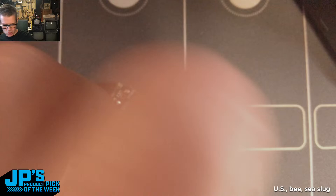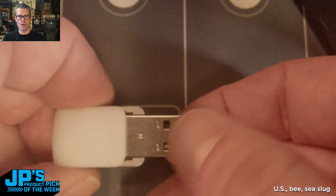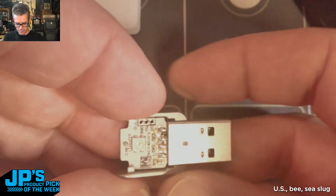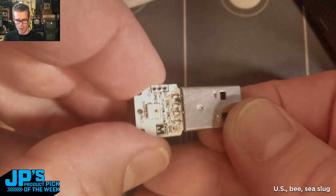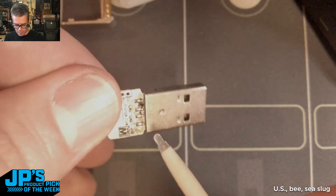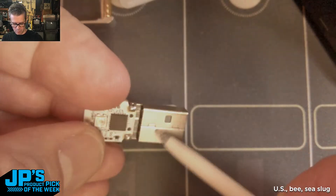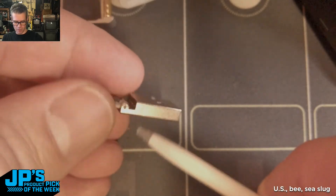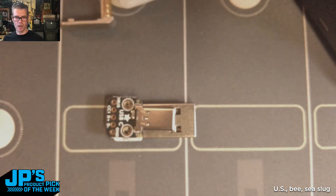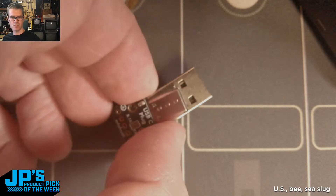There's a fairly standardized color set: green for data plus, white for data minus, red for voltage, and black for ground. So those connections go from the breakout to the board, giving a nice neat little package — but that could be any circuit you imagine. For a better look pre-surgery, this is another USB device: our good friend Todd Kurt's blink one, which is a USB-A programmable NeoPixel or RGB LED pair. You can see right at that connection there are four solder points. It's a pretty destructive process because you have to peel open these USB-A cases with pliers and desolder, but you get down to a pretty small board that could be soldered onto our USB-C connector, moving it into the USB-C world.